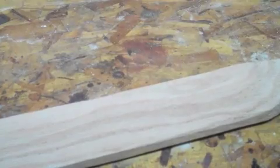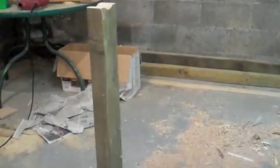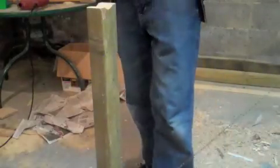Basically, how you do that is you put it on the tillering tree, and if it stiffens up on certain spots, like you can see it doesn't bend, or if it's bending too much on spots, then you know those are places you have to take it down.